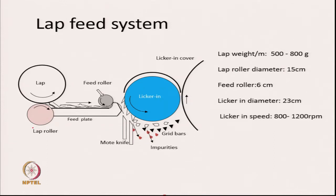The lap rests on the lap roller, which is usually made of wood, and the lap roller gets its drive from some source. As the lap roller rotates, the lap resting on it will also turn and be unrolled. The lap, being very flimsy, has to be supported before it reaches the lickerin. Hence, the feed plate exists which acts as a support. The lap moves over the feed plate, pushed by the lap roller, and comes in between the feed roller and the feed plate. The feed roller is positively driven, and its frictional grip on the lap sheet will pull the lap forward and present it to the lickerin, which is turning at high speed.